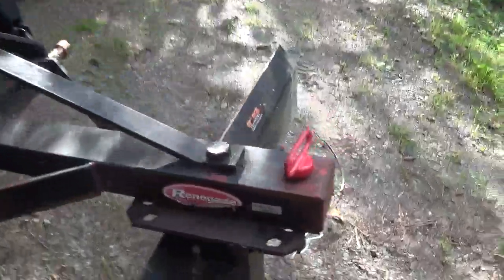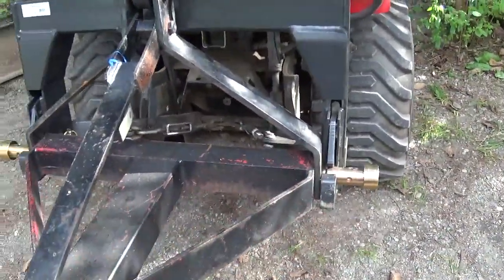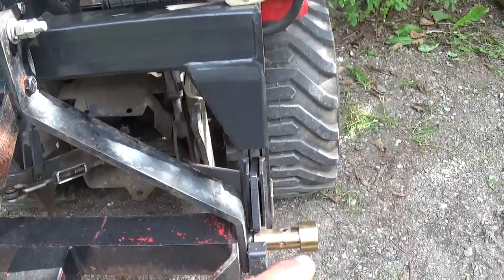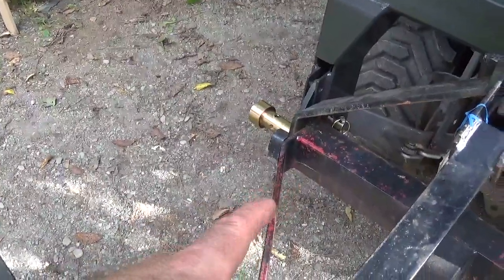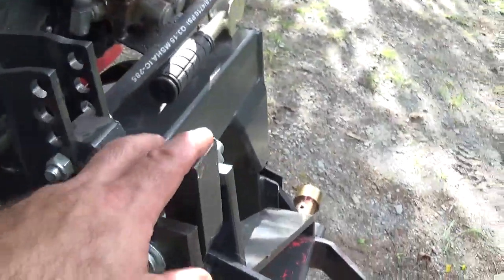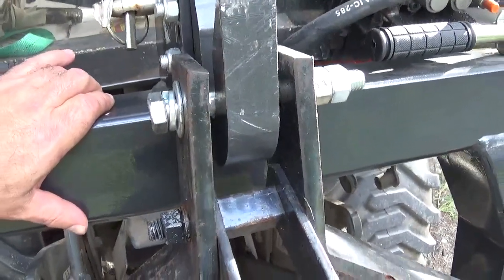it's going to be easier to install the blade. The blade is the part that was lighter, but with the fixed pin on it and the subframe with the backhoe there, it's hard to install the blade. You need to put one side, put the pin, and then install the other one and move it around. With the quick hitch here, there's this hook here, and I'll need to remove the pin and install the pin the way it's built, but it's not a big deal.